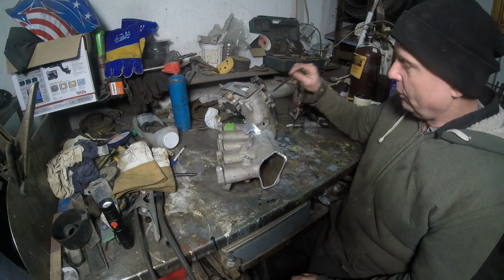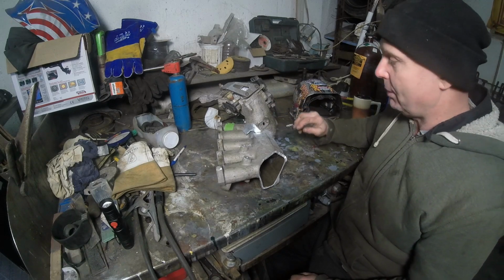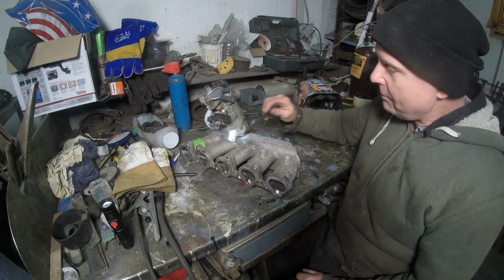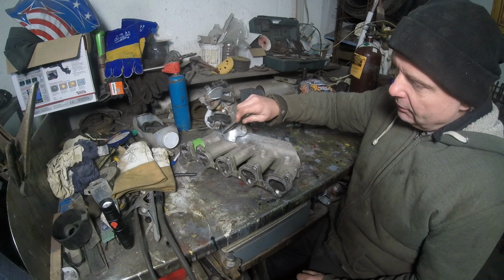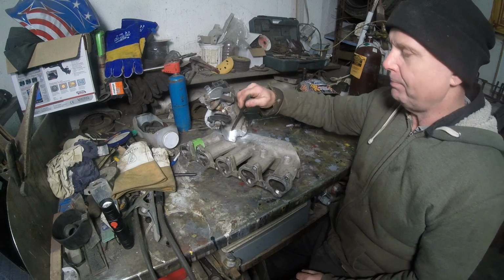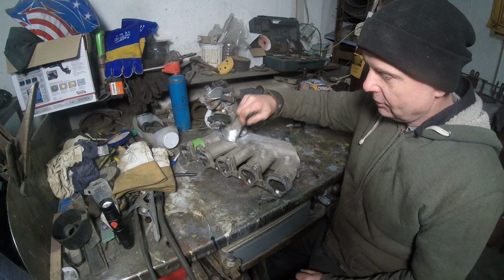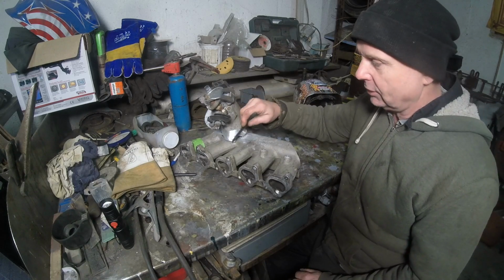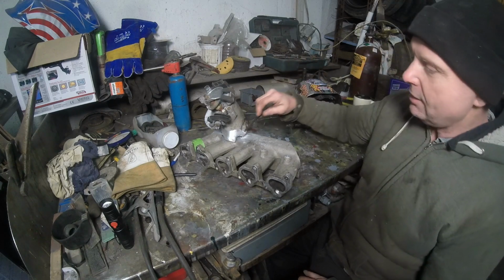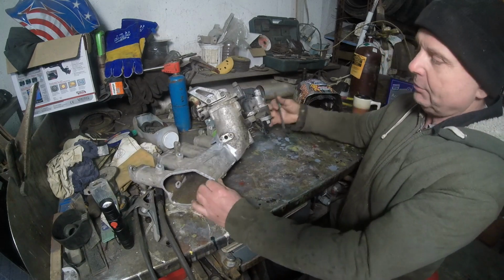I have to pull this off so the heat doesn't affect it, and weld up this. I'm going to use a lot of filler rod, but I'll weld that up and weld up the top portion. What that will do is give me enough stability for me to make a slice and cut and bend this down. Use like a half width slice in here to bend it down in order to contact this part of the manifold. Then weld those sections up, and then we can move on to the other side and start piecing that in all together.